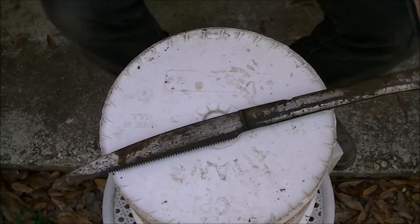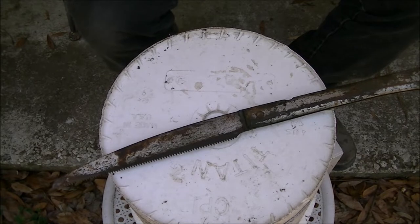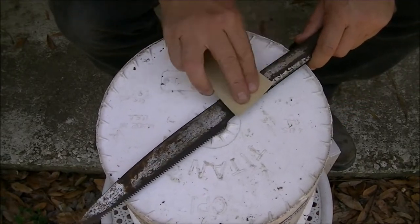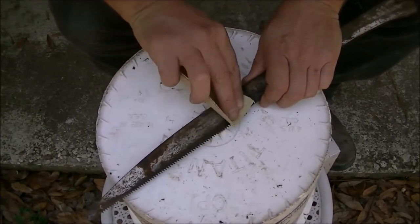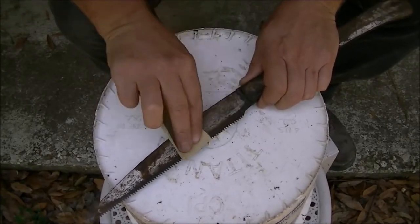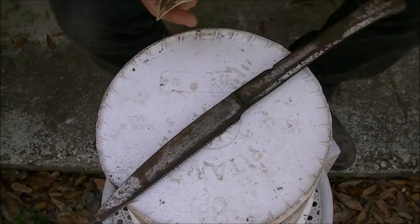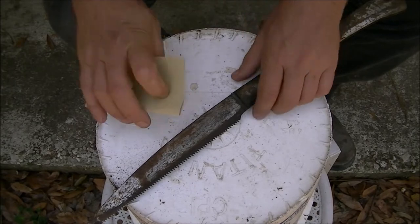I've got some sandpaper over here. All I've got right now is 80 grit and 120. We're just going to be sanding the paint off of the blade, the handle. I don't have any paint stripper, but as you can see, it's in pretty bad shape. Looks like it'll come off the blade fairly easy. Well, wait a minute, I do have 60 grit too, so I think that's the coarsest I've got. I'd like to have 40 grit, but